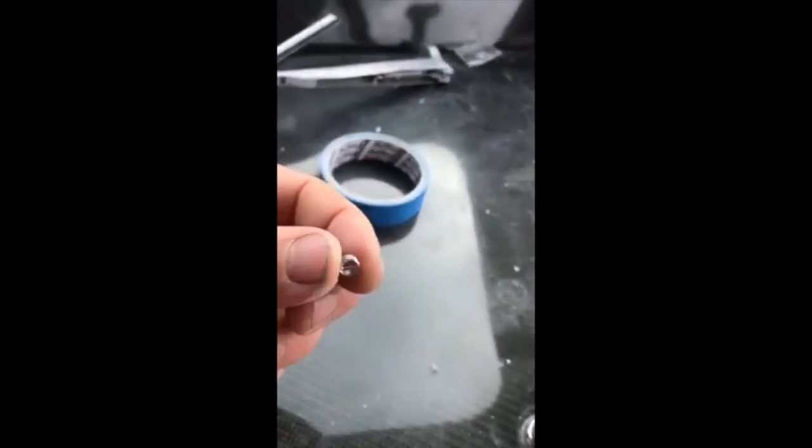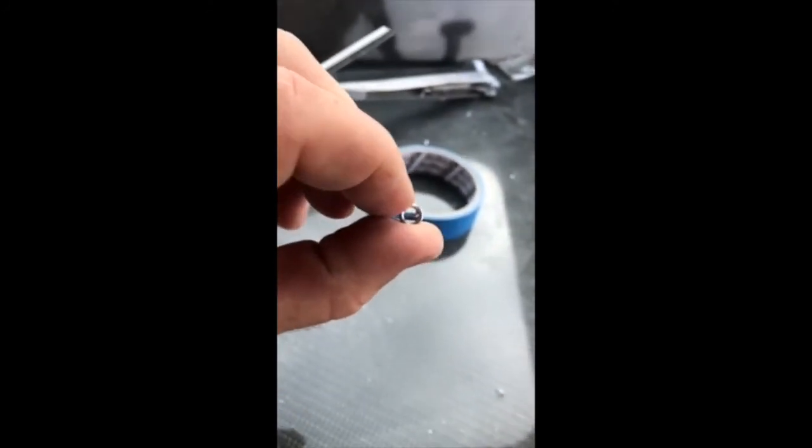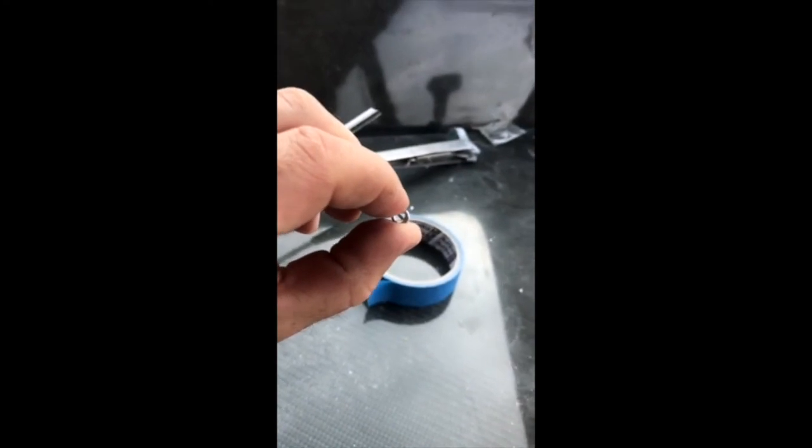You can see here they've had issues before with this window leaking and stripping the screws, so they've put a few bolts in. What we're doing by upsizing to the next size up in diameter with a metal thread allows us to tap straight through this fiberglass. Where these holes have already been drilled out bigger, it's going to create issues. So to combat that, we've brought ourselves some what we call helicoils. Basically, what's the best way to describe these little babies? It's like a threaded nut or insert, which means we can go next hole size up, have a special little tool. These guys thread in, and that way it means we can keep all our bolt or metal threads the same size.